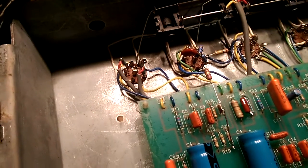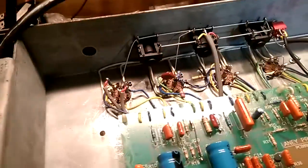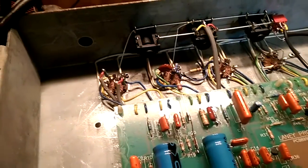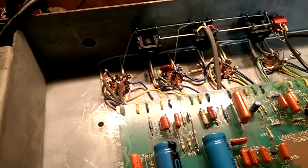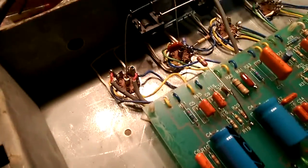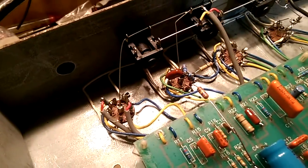Here we are. A quick little skanky hookup just to test it. So we're getting some oscillation off this tube that's kind of bad — I'll end up fixing that in a minute in the cathode; the resistor's just hooked to the ground. But anyway, it's just a quick dirty hookup, and it's all hooked up. Tone will still be the same whether I fixed the oscillation or not.